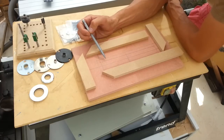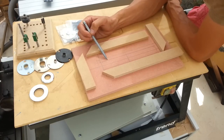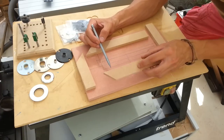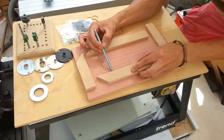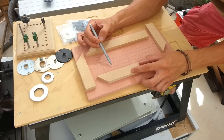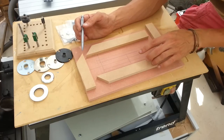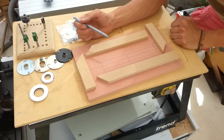Now, if I wanted 30mm on my final workpiece — say a 30mm mortise — I'd need to mark 11mm out because the template needs to be 11mm bigger. And then to use this method to cut the template, I'd need to mark another 11mm so that my final template was here, and then the final cut was here. This principle works for every single jig we make — it doesn't matter what the shape is. As long as we keep to that same principle, we'll never go wrong making a template.